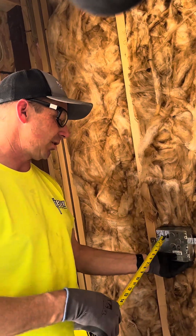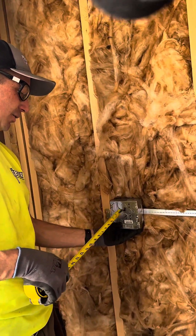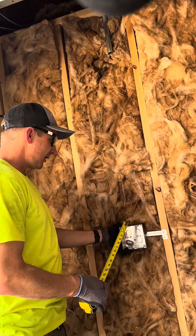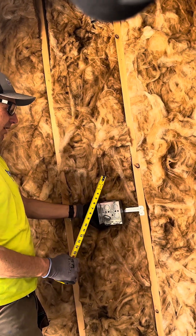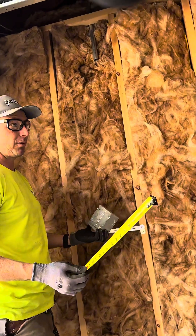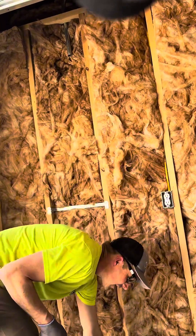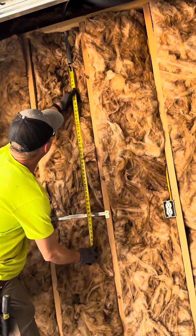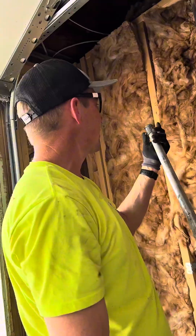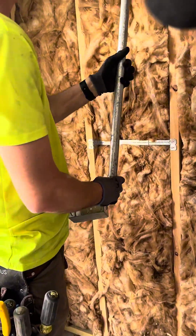If you're going to be putting drywall or any finish on this wall, you want this box to be flush with the studs. This box is four and eleven-sixteenths inches. So instead of trying to hold it here and get a measurement, I know I can just measure to the center — half of four and eleven-sixteenths would be two and eleven thirty-seconds. So I can just deduct that off of this measurement right here. I'm not tightening any of these couplings or connectors yet because I just want to see how it all goes together first.